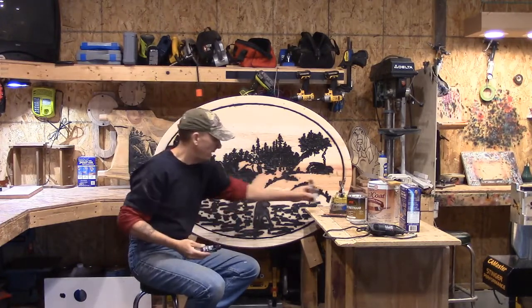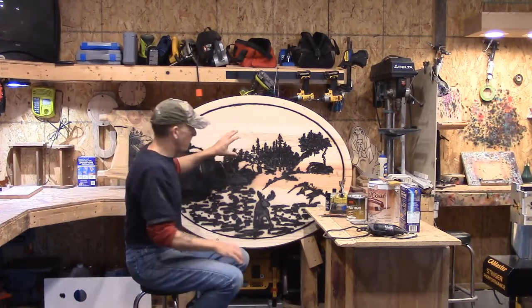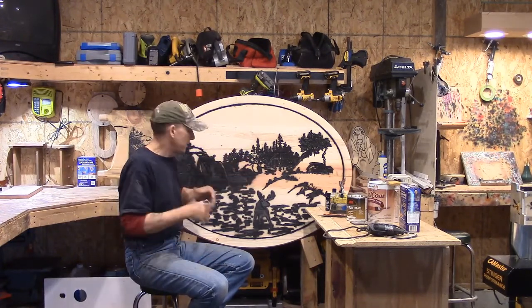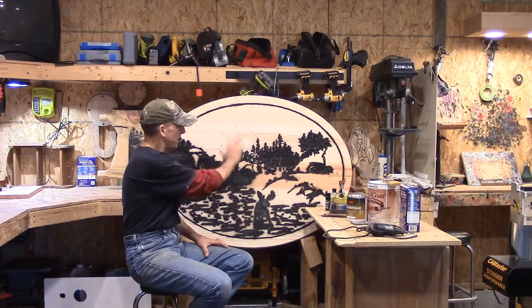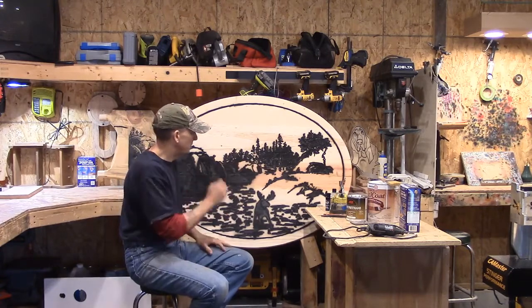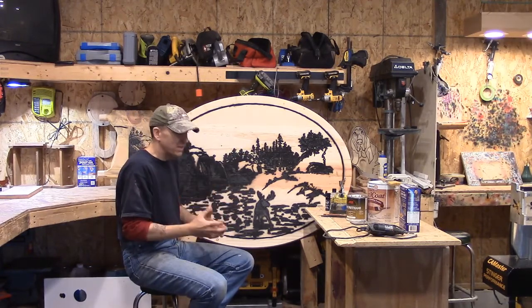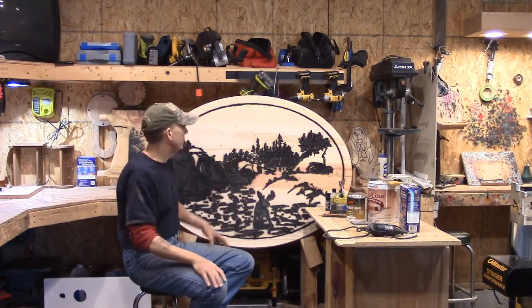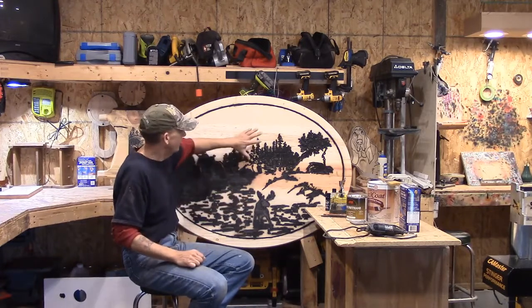This stuff cleans up with a reducer glass cleaner and distilled water when you need to clean your gun. Now that it's been airbrushed and had all night to dry, this morning we're going to sand any overspray off, and if I nick an area with the orbital, I'll go back and touch it up. I didn't want to make you all sit through the airbrushing — it's even more basic than paint by numbers. One color, 50-50 paint-to-reducer ratio. Try to keep overspray minimal, but if you get some, it's not the end of the world.